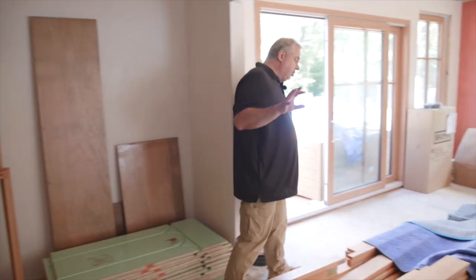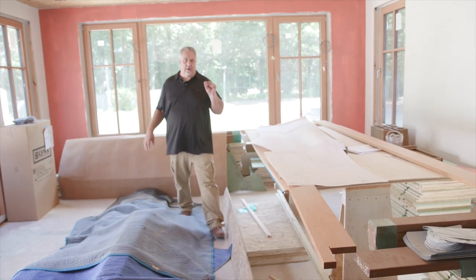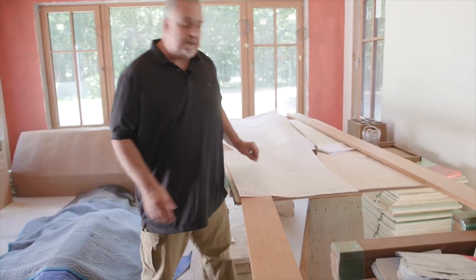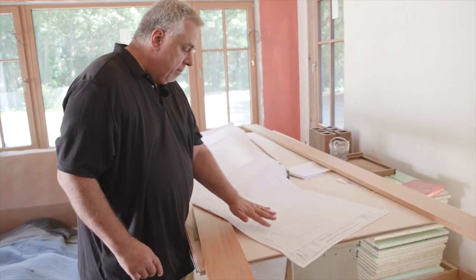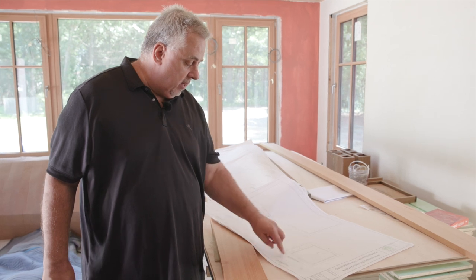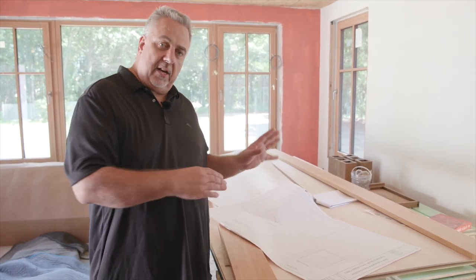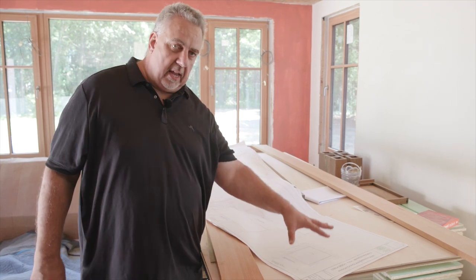I'm going to show you the extent that Traditional Woodworks goes to to ensure that things are done right, accurately, and very efficiently. I have here a whole set of shop drawings — each of the windows is drawn in elevation. Dave came out, measured the rough openings, and drew all these up so the guys in the shop knew what size to make everything. They have all the horns, everything drawn in, matching my original drawings which show the original intent approved with the client. I get it approved with the client, send it off to Dave, Dave makes shop drawings, guys in the shop pre-package the units, pre-make the jams and head, and then they get installed.